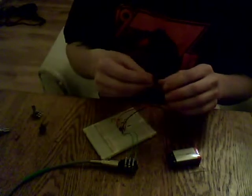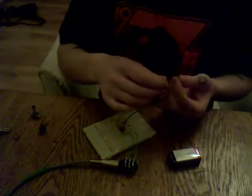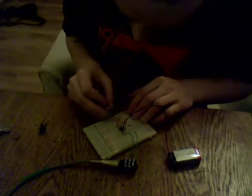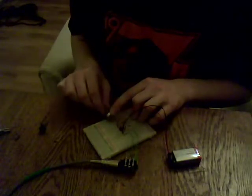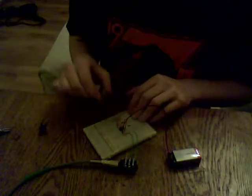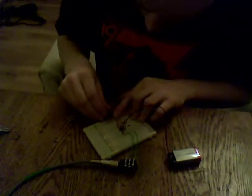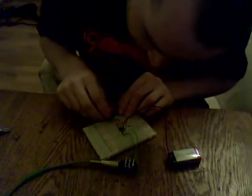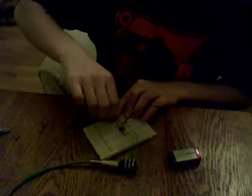So that's a bit better. But let's say you want it to have much lower frequencies and you don't really want those high ones at all. You could go up again with another fixed value resistor — that's 22k, a much larger value. If I pop this in and then pop the same 10k in... that's lowered the upper limit much more. And if I just put this one meg in with this 22k, it should get quite a nice combination. So that's the upper limit — same as it was with the other pot, but now you've got a much wider range.